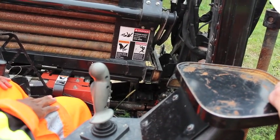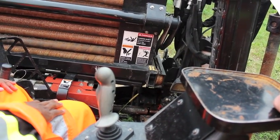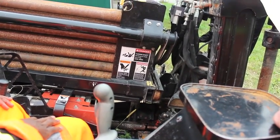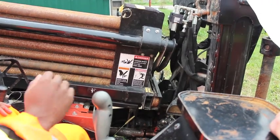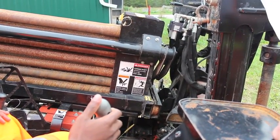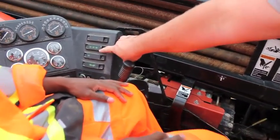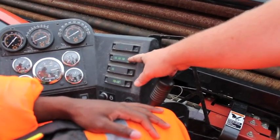After the threads are fully separated, we stop rotation and move the rotary head to the back of the frame. It must be fully back — pull back until the rotary head stops. We will also see four green lights on the second height in the cage.